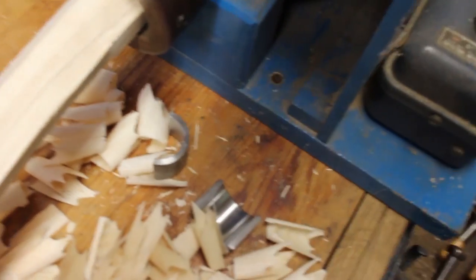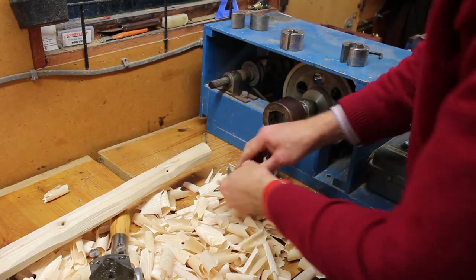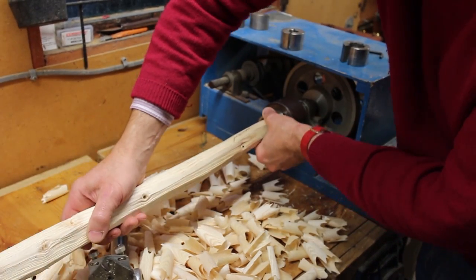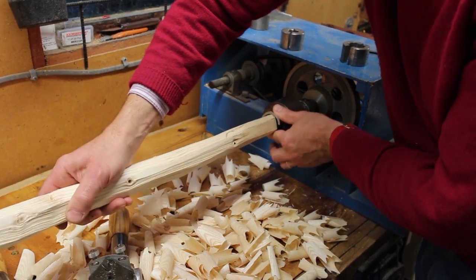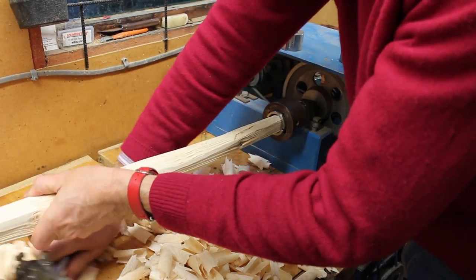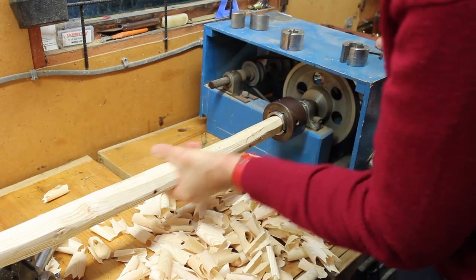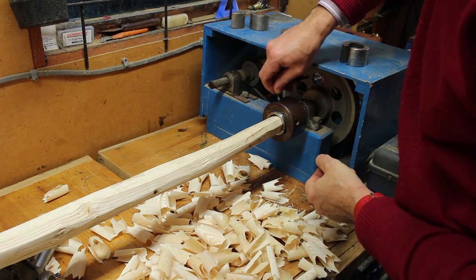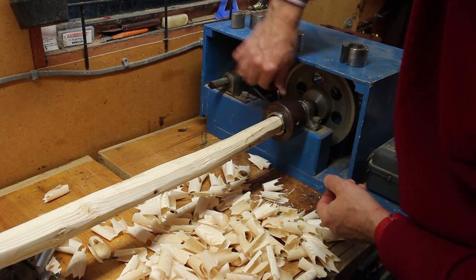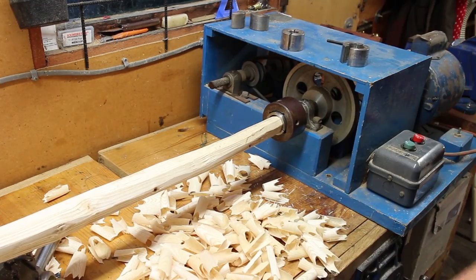I'll get it into the chuck and start tightening. To secure the wood I pop these little spacers around and force it in — it's just about going to fit. One could shave it if needed, but it's fitting fine. I tighten the little grub screw up with the allen key and that clamps it firmly in position — so that's ready for action.